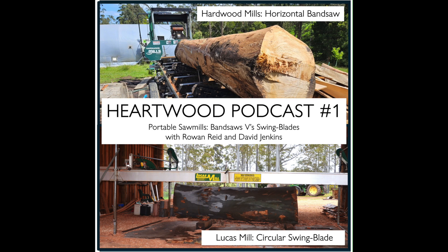You can do quarter sawing on the Lucas too — a vertical cut at the start, take the top piece off which is usually sapwood and bark, then dive in vertically into the middle of the log from the top. David tends not to do that — he goes back sawn. In the past he has mostly back sawn the log, only doing vertical cuts near the heart to get some quarter-sawn boards. Back sawing is more productive — you get more material out. It really comes down to whether the quality difference or your market actually cares about the distinction.